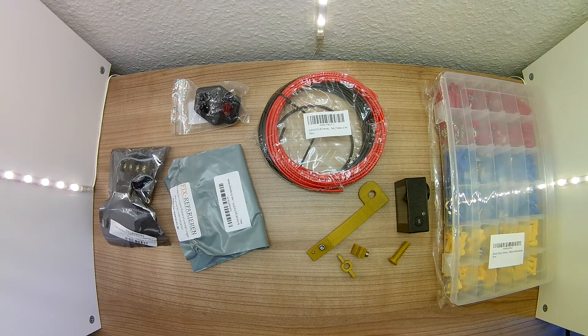You should perhaps also check it if you are printing and the heating bed is on. Please touch the cable — the power cable to the heating bed, or the green plug at the motherboard that leads to the heating bed, or also the white plug — whether these are really hot. Please also pull the plug out, the green one at the motherboard or the white one at the heating bed, to check whether there is already something melted or brownish discolored. Because it is not good when it comes to cable fires. So be careful, there seem to be problems — that is why I am doing this.